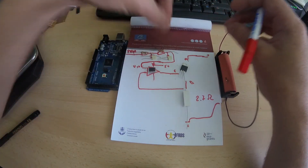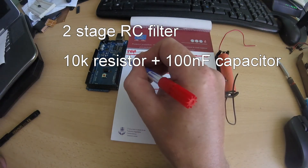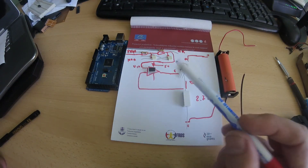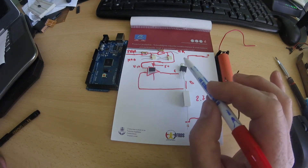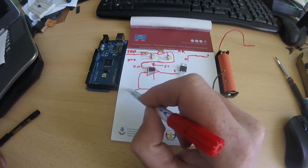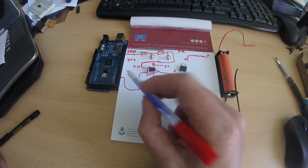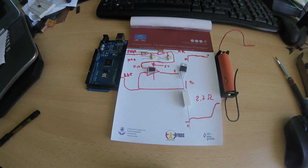So these are all the parts you need to make this constant-load discharger: two 100 nanofarad capacitors and two 10 kilohm resistors, plus the LM358. We also want to know when to stop discharging, so I'll use an ADC — an analog pin — to read the battery voltage and monitor the battery state. That's it.